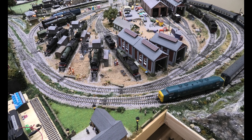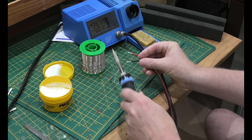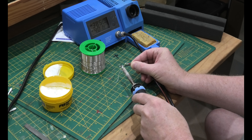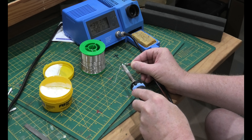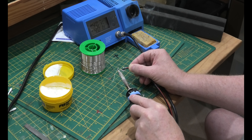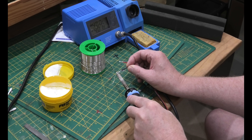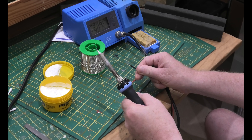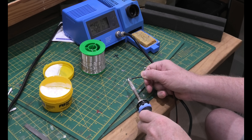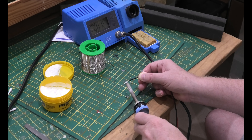I'm going to do it another way — a little more complicated but without disturbing the track. We've got our power cables here, I've stripped them and put them in flux. I'm now going to tin them. Tinning is quite simply melting solder onto the wire so it covers it and can connect to the track more easily.